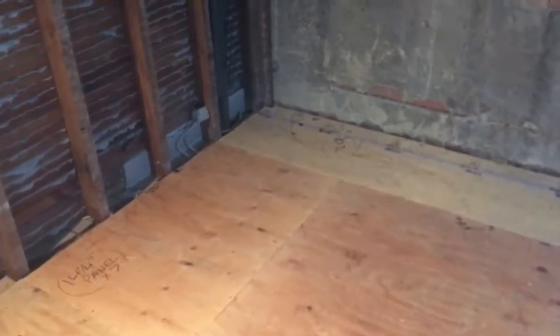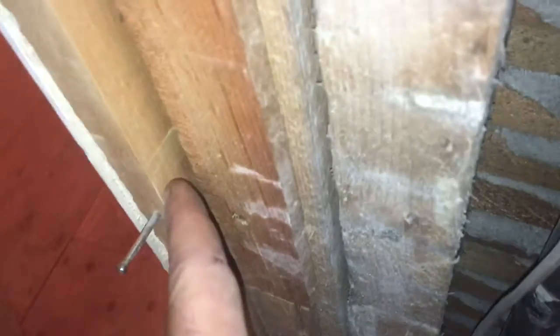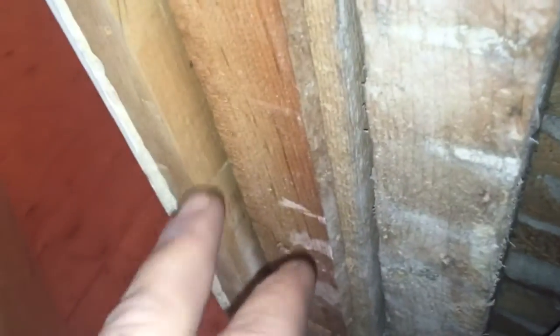I just wanted to shoot a quick video showing you the layout of the living room, paneling and whatnot. I've started off with this existing wall because that's already framed. However, the existing framing is a little bit further back than the paneling we're going to be putting on here because the plaster and lath was much thicker, and we're only going to be using a 1/2 inch MDF backer panel to sit all the molding pieces on top of.